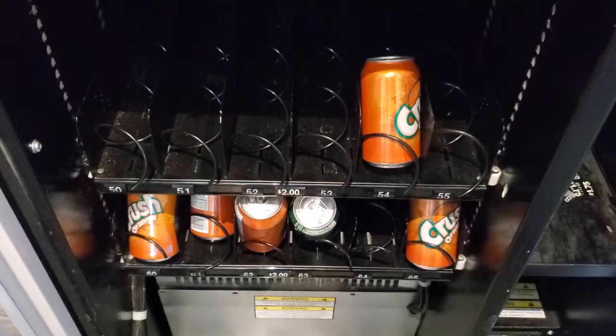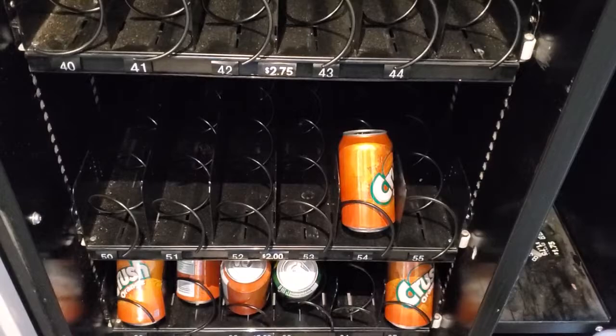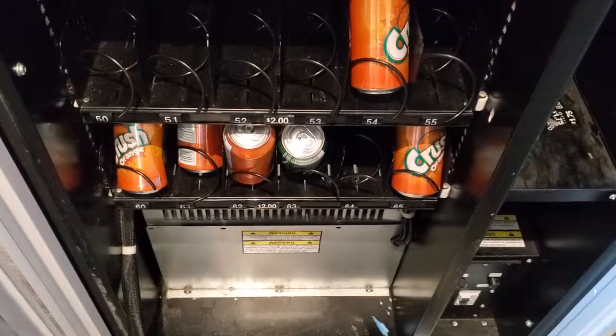I think 15 degrees is cold enough for people to drink — it's still always sold out even when you set it at 12 degrees Celsius. You save electricity and at the same time you prolong your compressor's life by more than 50 percent. Thank you.